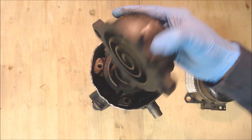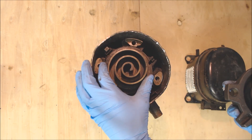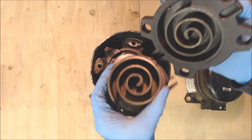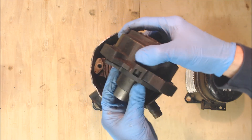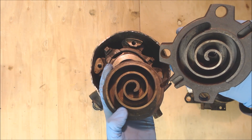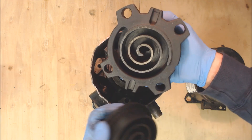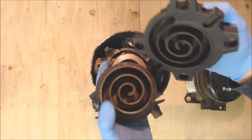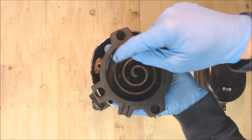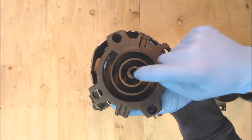This part right here is fixed, and you see here's one part of your scroll, and then here's the other part. Basically what happens is this oscillates, and the two actually move like this in order to take your suction gas coming in the side, and then it exits out the top right here compressing it. So it's kind of like a rotary except it has more surface area on it. That suction gas will go in this area, and it'll get tighter and tighter of an area until it then ends up pushing out through the top.